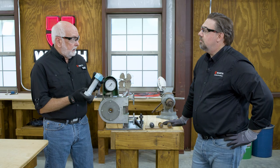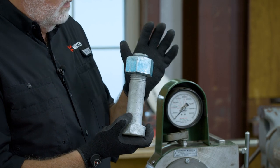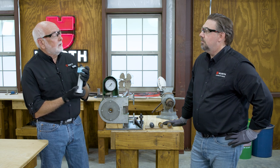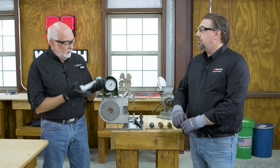The rotational capacity test is mandated on A325 structural bolts that are hot dip galvanized. A rotational capacity test is a bit of a misnomer — it gets confused because people think it's a strength test or a ductility test. Really, it's about whether this lot of bolts, with this lot of nuts and washers, will create a stable, repeatable connection and reach the required tension.